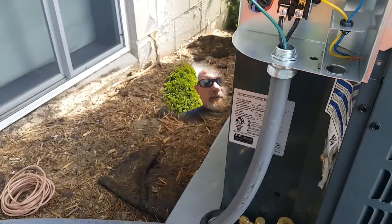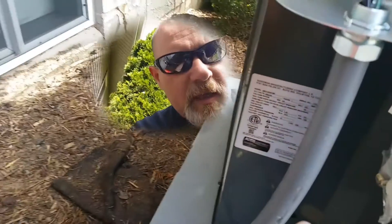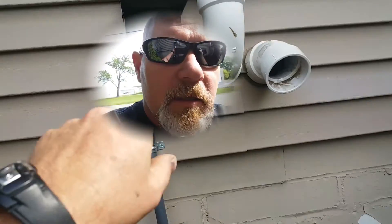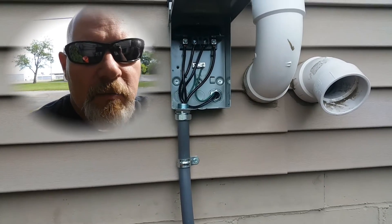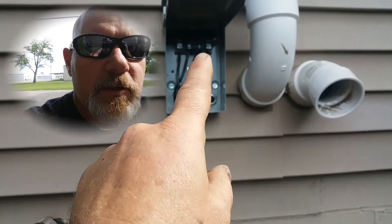And that's it — that's all there is to wiring in an air conditioner. The only other thing I'd say is right here, you'd want to make sure you check your rating plate. Make sure that your disconnect, if it's non-fused, you're okay, but make sure your breaker is set right at the breaker panel. And if you're using a fuse disconnect, make sure your fuses are rated for what the rating plate says.